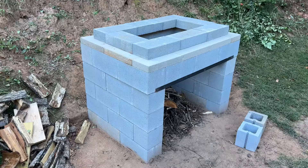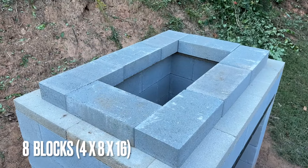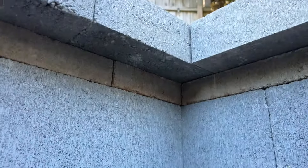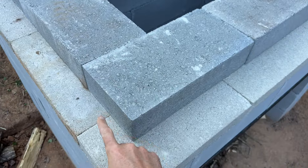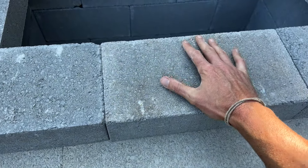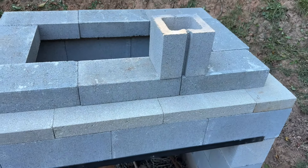This is actually going to take 10 pieces to complete the top under this design, and it's just going to seal up the base a little bit more and get it ready for the next level, which is adding in the four-inch-thick concrete block to build up and start to create our chimney stack. We picked up some four-inch block again from the hardware store and we're going to overlap those just a little bit to inset them away from the main firebox. We've got these not sitting completely halfway over, but just over a few inches each block, and that's going to create a little bit of an overhang, start to narrow down our firebox, and help create the stack. The corner pieces are going to be more supported because they're touching two blocks, but the middle ones are more likely to fall in until you get your next row going. Overlap those joints and that's going to make everything nice and secure — I'd recommend going at least three high.